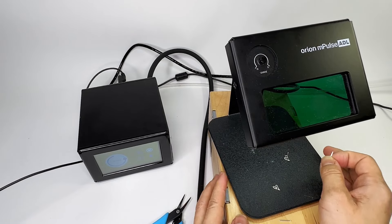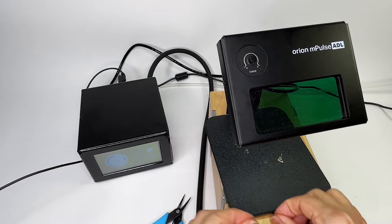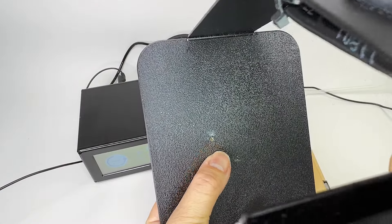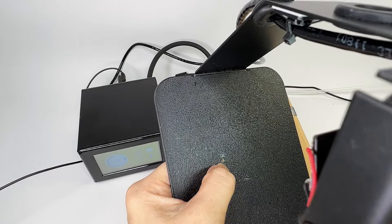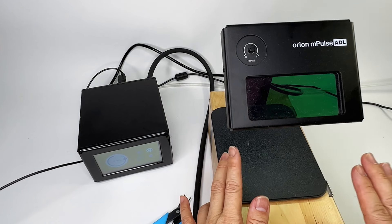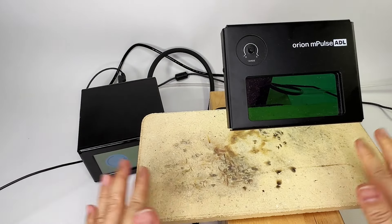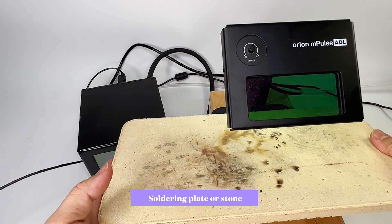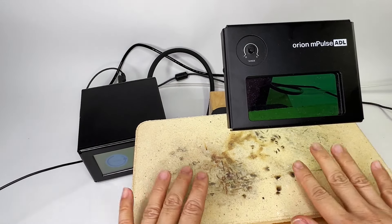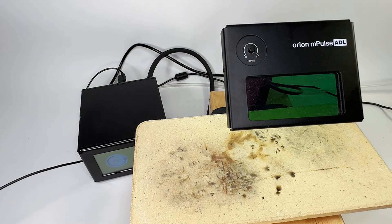I really like my ADL and I was welding on it because it has a light. The problem is with welding for jewelry making — it has high heat and you might make a mark or burn through. What you can do — I'll show you — is use this, which I use for soldering. They sometimes call it the soldering plate or soldering stone; basically it is something that dissipates heat, doesn't crack, and protects your table.